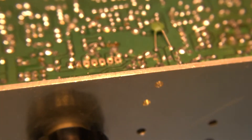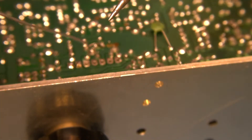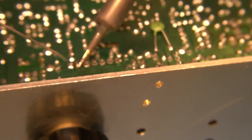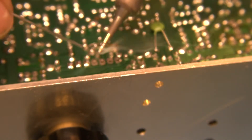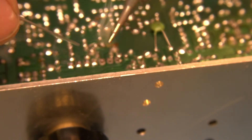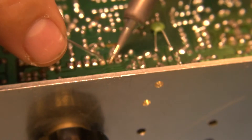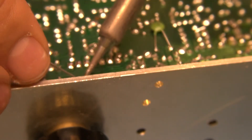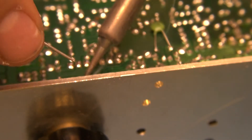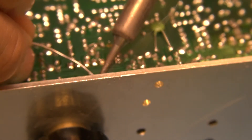I don't think my iron's hot enough. This board is really low quality, so I've been trying to maintain the heat carefully, because if you use too much heat on this board it'll just peel up the traces. So you have to try to find a happy medium.